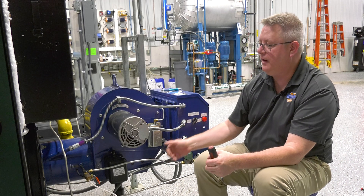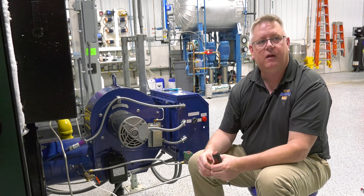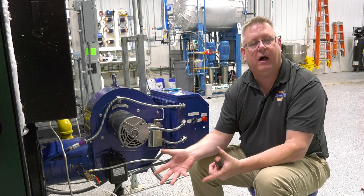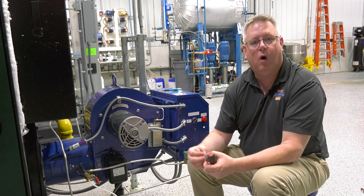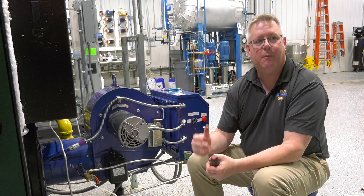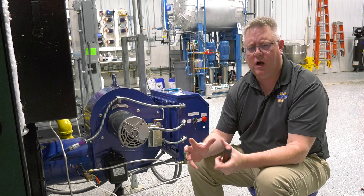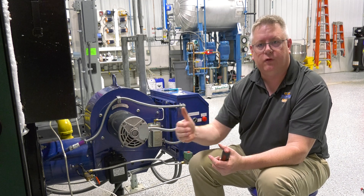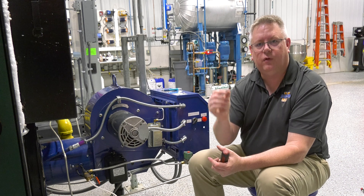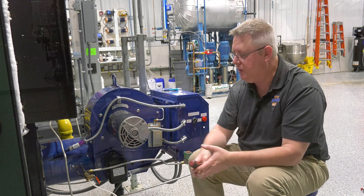There's a test we can do called the pilot flood test. We'll let the solenoid energize without the ignition transformer powered, and we'll apply the spark five seconds into the pilot trial. If we've got too rich of a mixture, it actually won't light at that moment. What we want is a gas-air mixture that will reliably light at any moment in the 10-second pilot trial. If we've got too much gas, it's only got a very small window to be successful, and that's not the best for reliability.